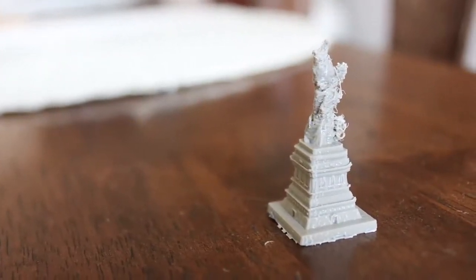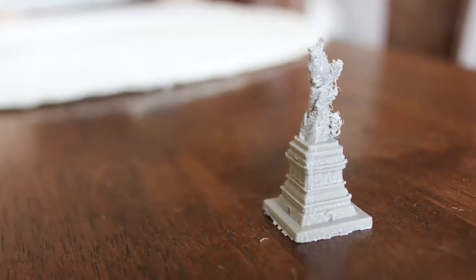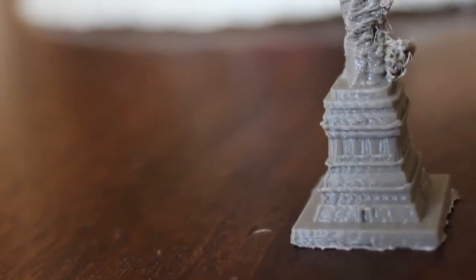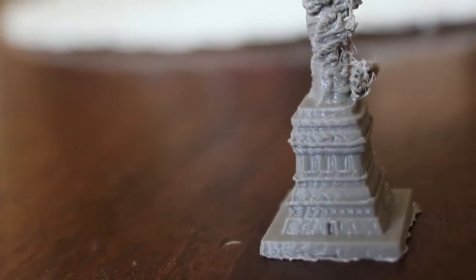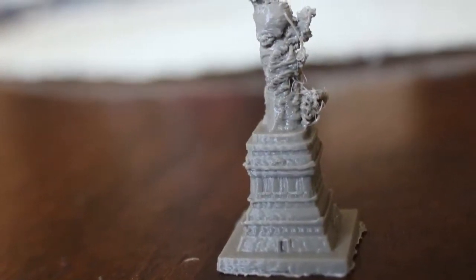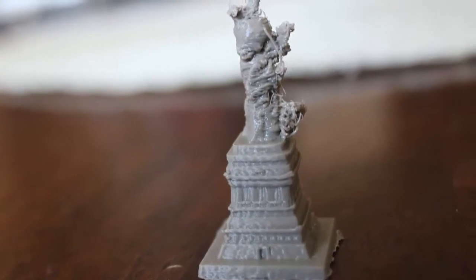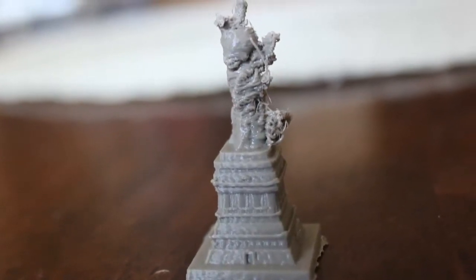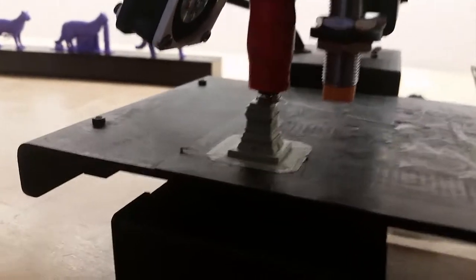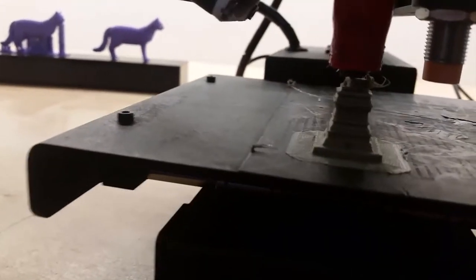And this is no fault but my own. Just like the actual Statue of Liberty, this model has a lot of overhangs — for example, just below the arm and on multiple areas of her dress. The printer tries to address this by placing little support platforms, but this model was so tiny that the plastic coming through the nozzle, which has a diameter of 1.75 millimeters, was too big for the upper part of the statue. So as it was building these little platforms, it was melting onto the statue itself.